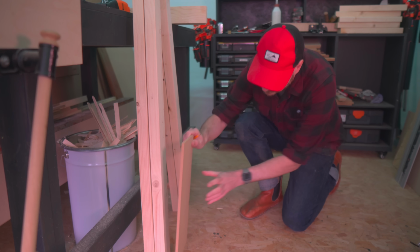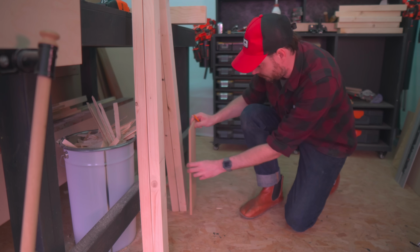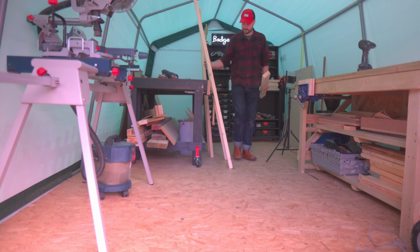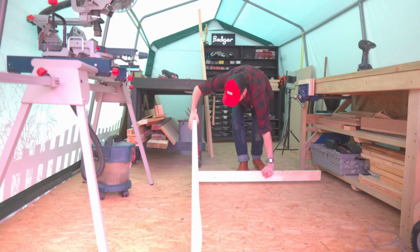So two of the supports are going to go at the bottom and they're also going to act as a shelf. I've got a scrap of wood where I can mark out the shelf height. Now I'm having my shelf quite high up so I can get bits underneath it on the floor. But if you're hanging longer items like dresses, you'd probably want the shelf lower.